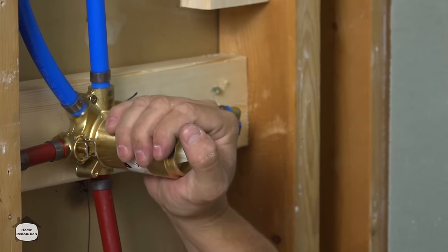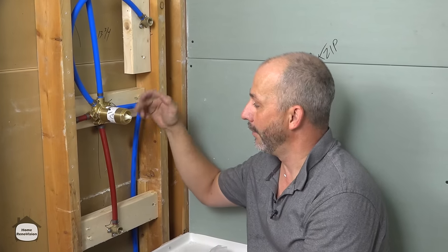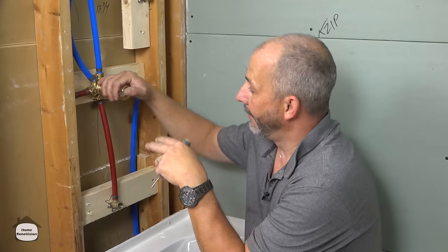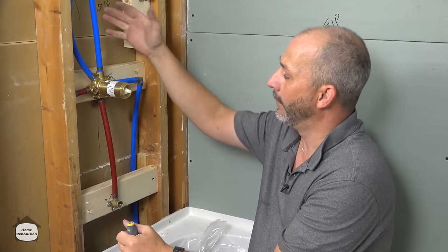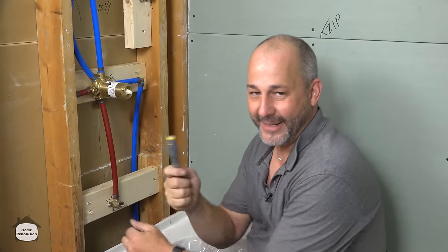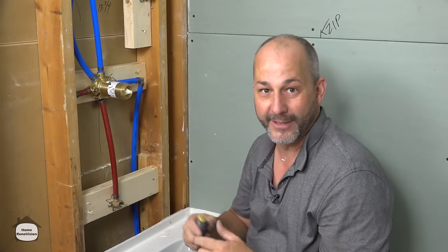Okay, now remember this is a mixing valve and it's just the test cap in here for now. All right, so the water will flow freely. And if you leave the lines open with that system in place, then the hot water will actually heat the water in the cold line. It'll run all the way back. God only knows. I've seen situations where we've done this and the hot water works its way back to the toilet. Then the toilet starts to sweat profusely. Client will call on the weekend, my toilet's boiling hot.